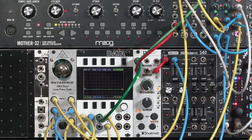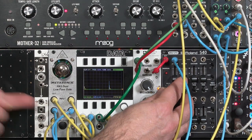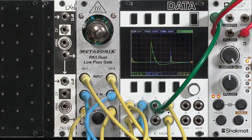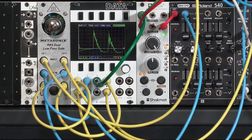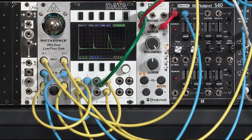I have typical white noise from the Moog Mother 32 going to channel 1, and I start to increase the decay of the envelope feeding the CV input on the RK5. The green trace is the audio output of the RK5 — you can see what looks like an envelope shape. One of the idiosyncrasies of the RK5 is it has quite a bit of CV bleed-through, meaning you get a big subsonic DC thump in your sound. The wiggles are the noise, and as I increase the decay, the noise component becomes more prominent on top of that thump. Just by playing with the envelope driving it, you can change the character of the sound.